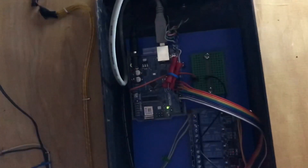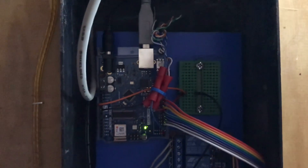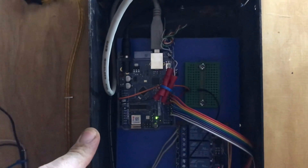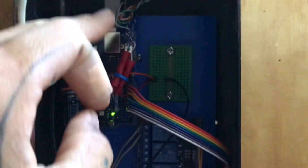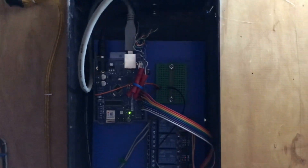That system is charged by a single 100-watt panel on the roof, which I'll show in a minute. This is an Arduino with Wi-Fi - one of the microcontrollers we use to automate things here. This one is hooked up to the rest of our system and gets updates from our main server, so it knows what to do, what time it is, and what the temperature is. It's hooked up via small wires to a temperature sensor in the studio and also one outside, and when the thresholds are met it starts to turn on these relays.